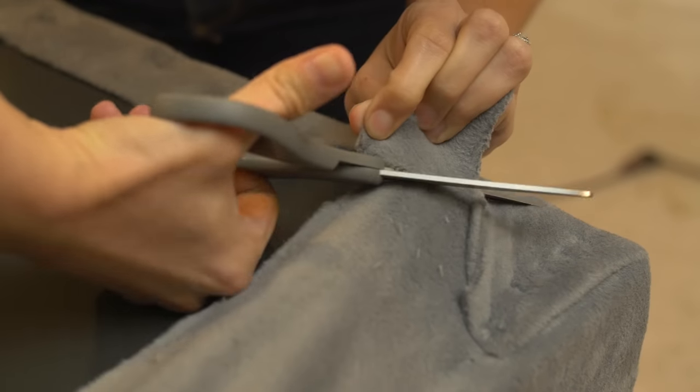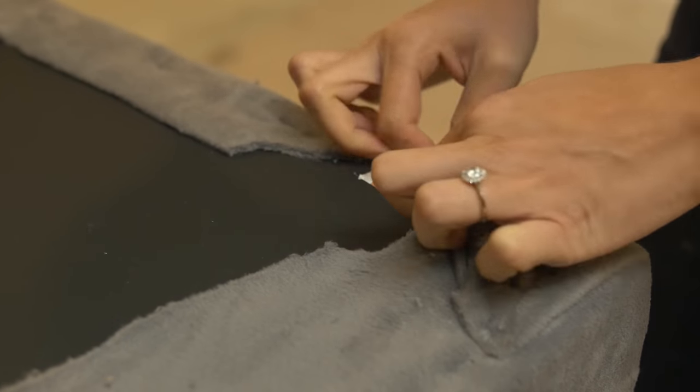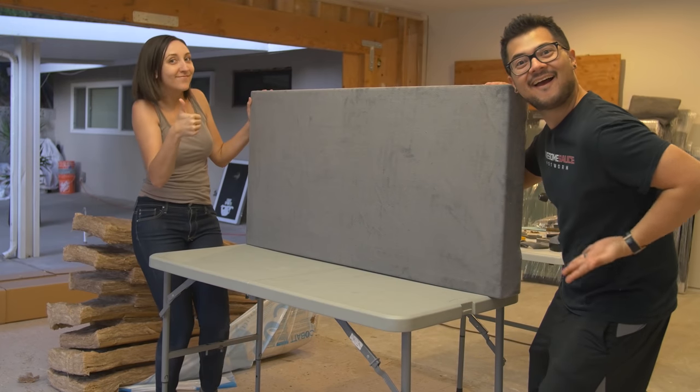Next up was the insulation installation. I simply laid the material snugly inside the frame, cutting to size where appropriate to fill the space properly. I made sure none of the material was spilling out of the frame before covering the area with a piece of fabric that I pulled taut and wrapped around the backside, before trimming the excess and staple gunning the entire perimeter. It was super helpful having Wifey pull one side of the fabric tight while I held the other and went about my stapling frenzy. It's also worth noting that I bought the longest staples I could find since they would need to penetrate the fabric, poster board, and wood for a proper hold. Some additional fabric needed to be cut out to make way for the D-hooks, and after some final bits of trimming and stapling, my first panel was complete!